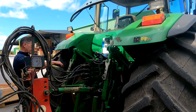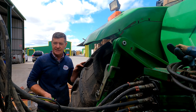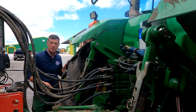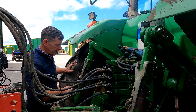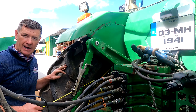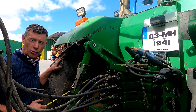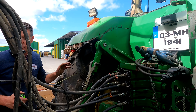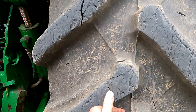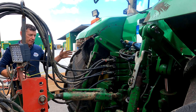This tractor is on 620s. You can have bigger tyres — we have 650s and 710s — and that's when you may need to change the boards in the plough to allow for a bigger tyre size. Obviously you need correct pressure and to have your tractor well ballasted. We have weights on the inside of the Air 410 and a front linkage with a set of weights out front to keep the tractor balanced and contact right down. You want to get as many lugs as possible on the ground when ploughing, so you might run them at a little lower pressure.